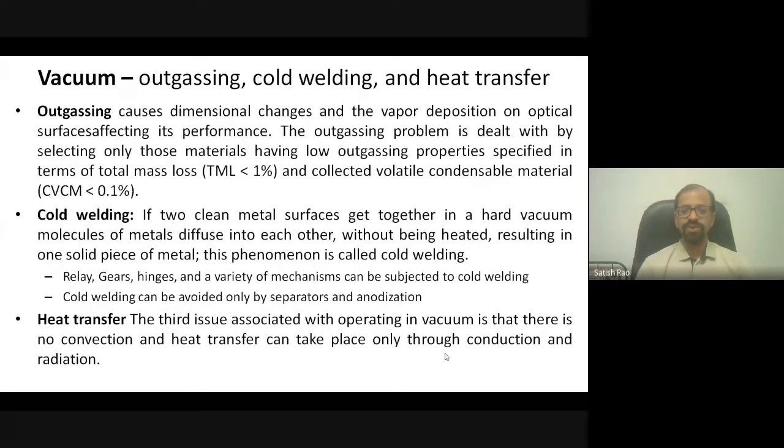When in vacuum, certain problems occur principally because of the vacuum itself. One of the most significant is outgassing. You may have noticed the smell inside a new car left in heat — that is outgassing from the new plastic materials, gases being released when subjected to heat. A similar thing happens in vacuum: certain materials lose mass as gases come out of them, and this is an important factor when selecting any material for space use.